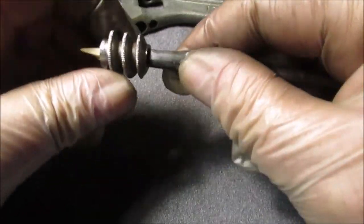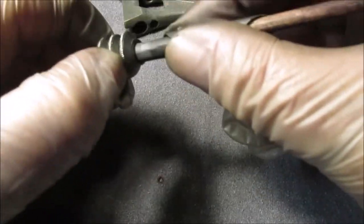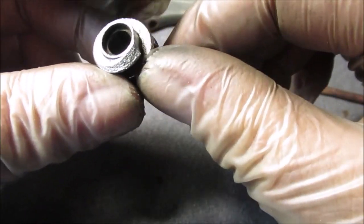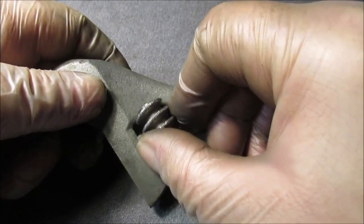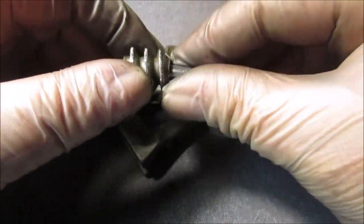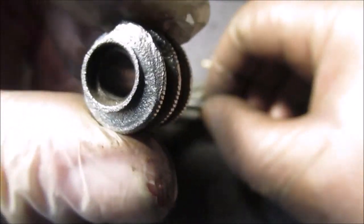I had it locked in the middle — wire brushed every way from here to next week. Now down in here, don't go mashing it in the wire brush or you'll just rip it up — use the Dremel. That's where the spring goes, see? It's recessed. The spring always goes towards this side of the wrench. I made that homemade one. You don't want rough sandpaper where your pin goes — you want it to spin nice and free, smooth.